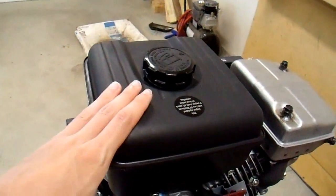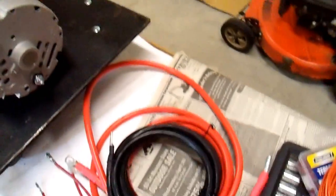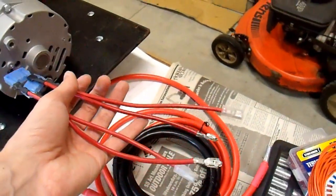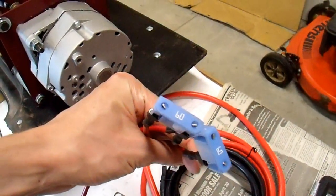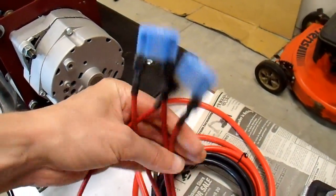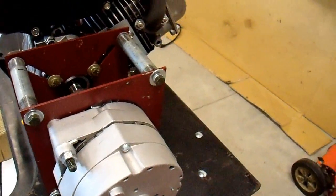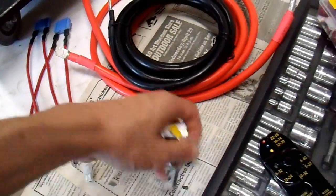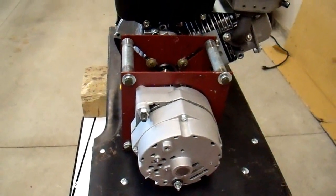It will consume more gasoline if I have loss in the cables, but that's pretty minor and I'm not too worried about it. These are 10 feet long and I don't want to cut them, so I'm just going to leave them. I'm also going to put in these fuses — I salvaged these off of an old UPS unit. They're 60-amp fuses, so I'm just going to put two in parallel. That way if the alternator shorts out or the diode rectifiers fail and end up draining my battery instead of charging it, I don't ruin my entire battery bank, and it's not a fire hazard.